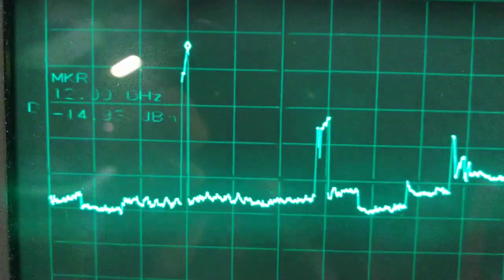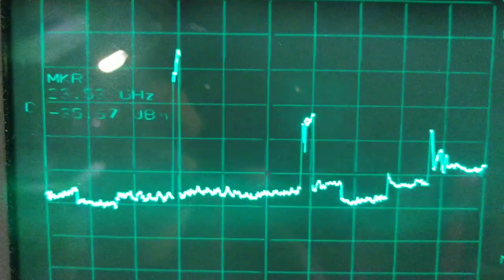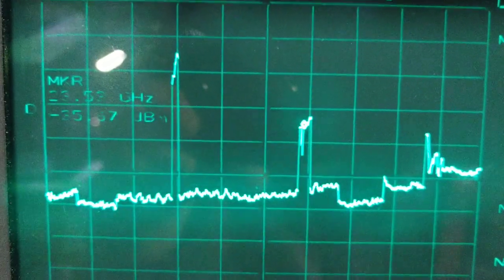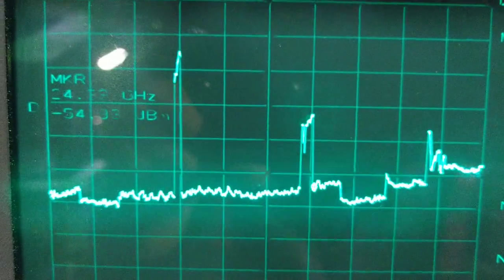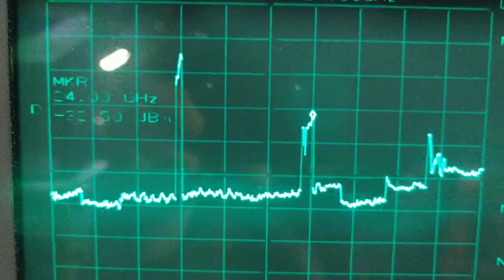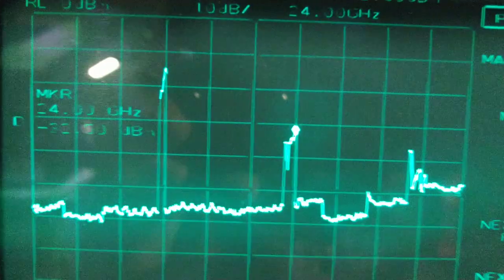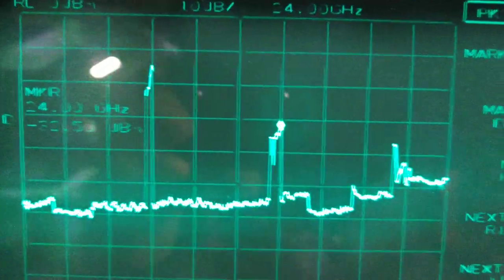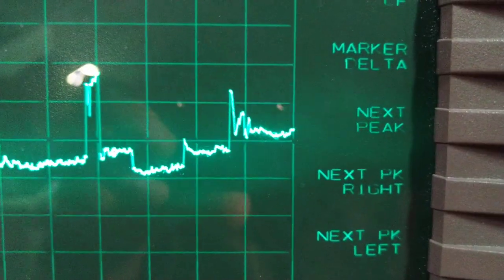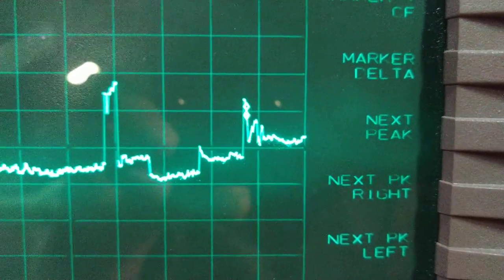And so when we move to the next one, we'll see it's on around 24, from 23.4 approx to 24 gigahertz with minus 32.5 dBm leakage on 24 gigahertz. And then we can still see that they're on the K, above K-A band, we have stuff emitted quite clearly.